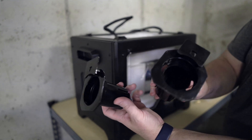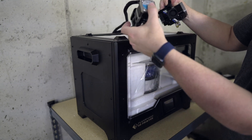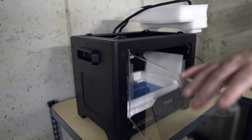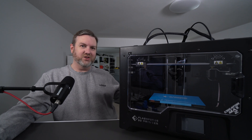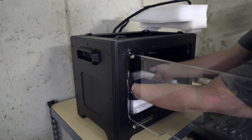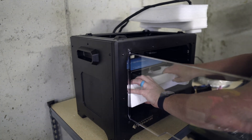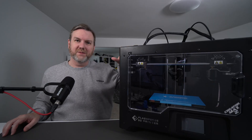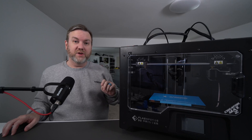There were two filament holders, which I quickly installed on the back of the printer. The two extruders did not come pre-installed — I had to put them in place. Inside the printer were two 1kg spools of filament, which I have installed on the back. To remove all the remaining styrofoam, I had to pull up the build plate — it took quite a bit of force but didn't damage anything. There were also zip ties and yellow plastic clips to remove before everything was free to move.